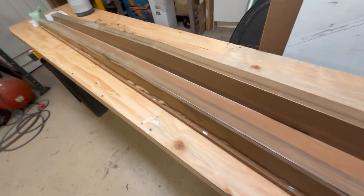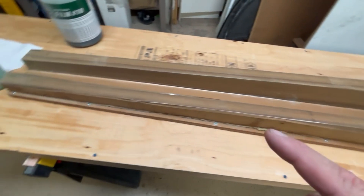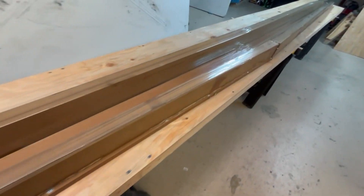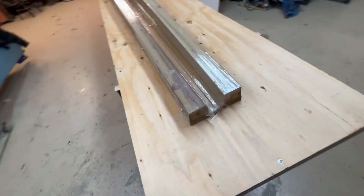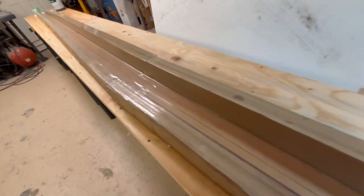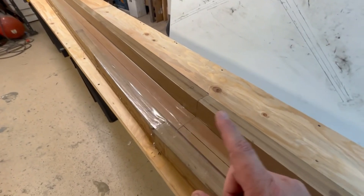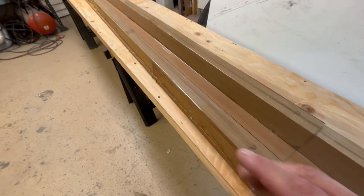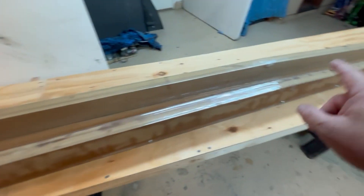Four coats of wax on, polished, and I just put down a generous layer of PVA. I actually use a breather cloth to apply it - it absorbs the PVA, I pour it in, slop it around, and make sure it's in there nice and smooth. This needs to cure for maybe an hour, and then I'm going to start dragging in peel ply. Peel ply goes in first because that's the surface that's going to bond to the upper and lower wing skin, so I want a nice bondable surface. Then two layers of carbon on the 45/45, and that's what we're going to try to accomplish today.